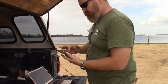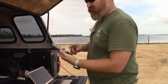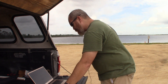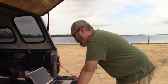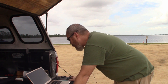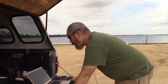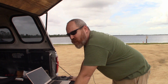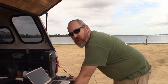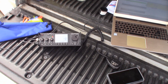I just got a buzz on my phone. After one call, I've been picked up on PSK Reporter by AF7KR — just running five watts here. And that was a success with November Two Foxtrot Bravo Victor. Looks like we're calling CQ again. My goal was to get set up and log 10 contacts on FT8. We got one down and nine more to go. I just realized I was running two watts out of the radio — that's not too shabby. So I bumped it up to five watts, but I don't want to run it too long at five watts because this radio gets hot.